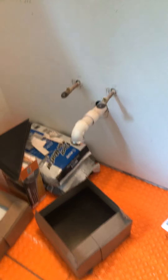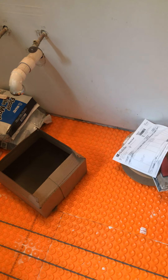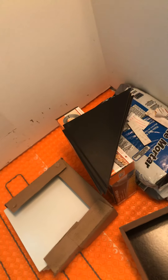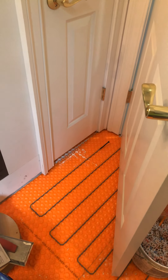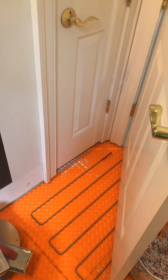I've got my stuff in here now. We left off a little ways there — that's going to be our leave-out for where our cabinet is going to go. The sink is going to go there, so you've got your vanity. We brought it up within five of the front toe kick, which is going to be located on that leave-out for the vanity, because you don't need to heat up underneath that — that's just wasted heat. Then we rewrapped everything else.